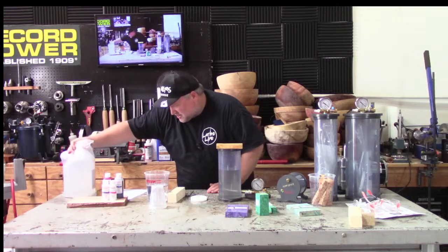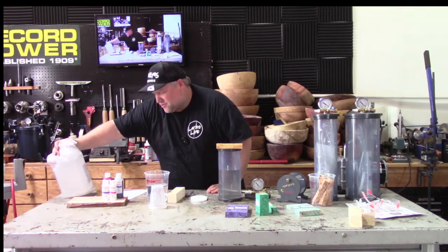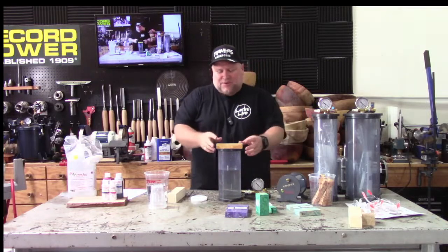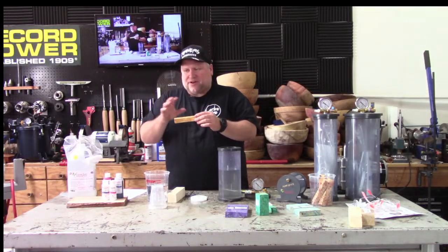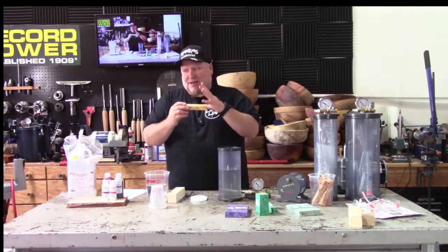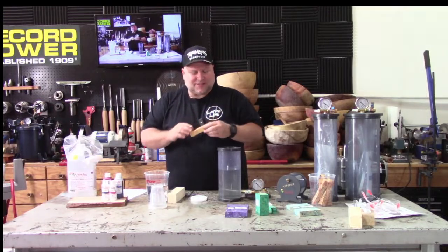I want to make sure it hasn't changed since he updated the formula. It says cure at 200 degrees for 2 to 3 hours or until cured. So 200 degrees. And what you want to make sure is you get that internal temp to 200 degrees, kind of like cooking a steak. However, once it starts to cure and you see crusting on the outside, generally that means the whole piece has hit that temp and it's going to cure. So usually you're safe when you get crust lines.